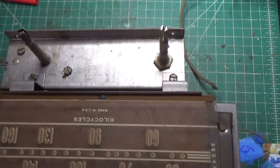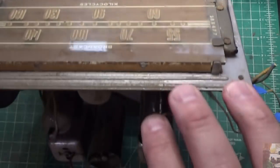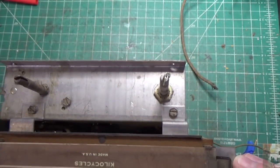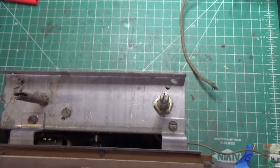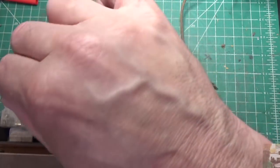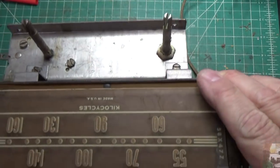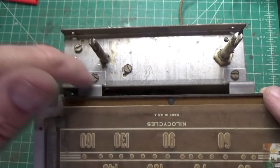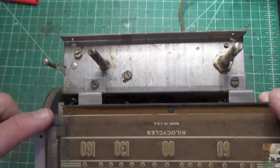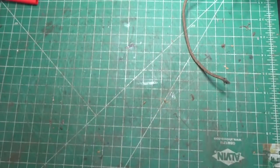This radio does not have a dial light, but it does have a piece of dial glass which I can remove and clean — there's a lot of dust behind there. And this is your tuner, this is where the dial string was wrapped around. I'm going to have to figure out how to route the dial string — it looks like it comes around here to this post and wraps around and goes back. I'll figure that out when the time is right.